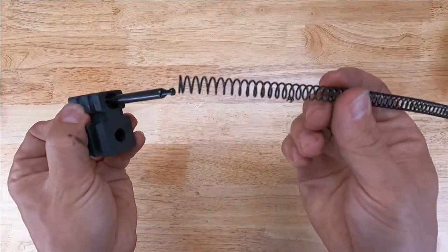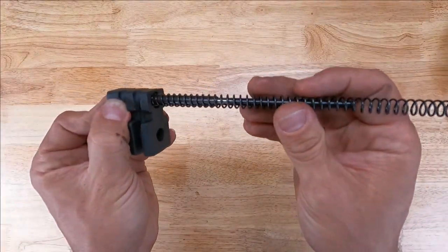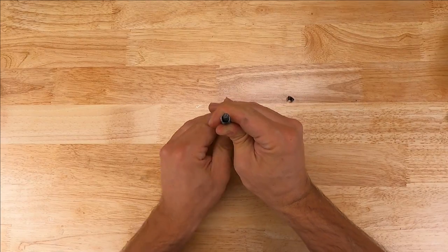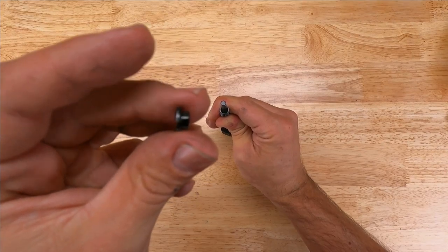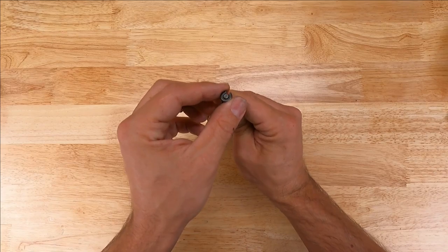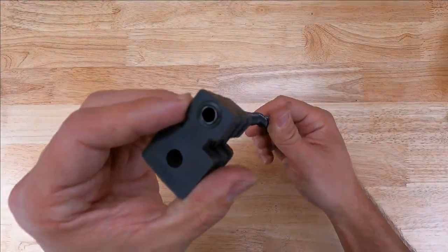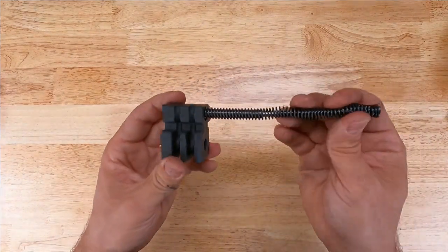Make sure the washer slips over the large diameter rod and down into the bore of the buffer. You can also slip it down with the spring — so next piece will be the spring. Slide your spring back on and compress the spring. Then we're going to reinstall the retaining clip onto the front of the rod. Slip it on and release the spring pressure. You should be able to turn the whole assembly once it's installed. This is a complete short stroke buffer assembly.